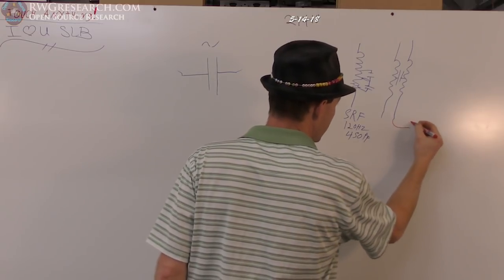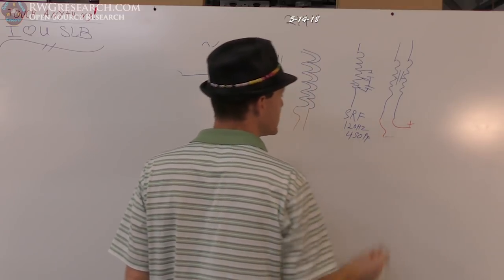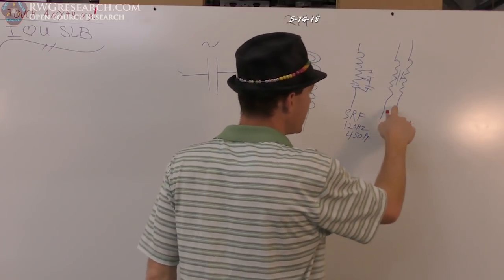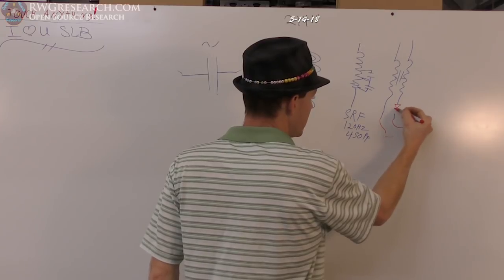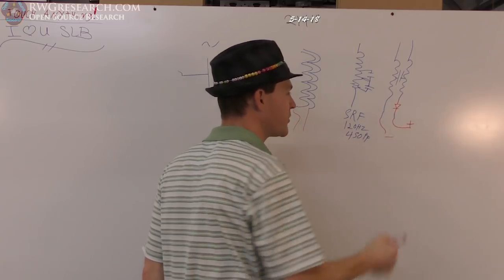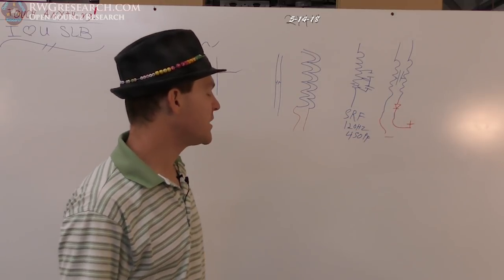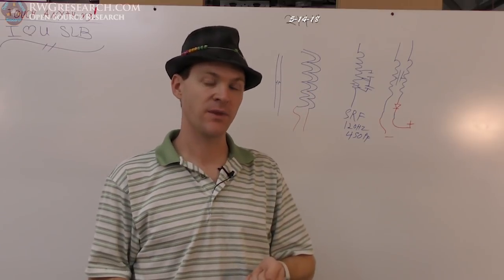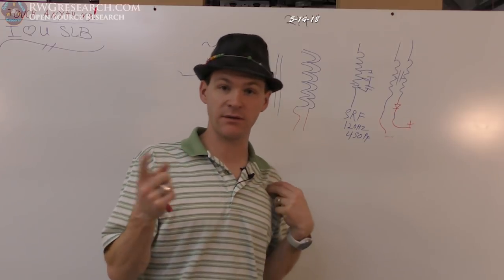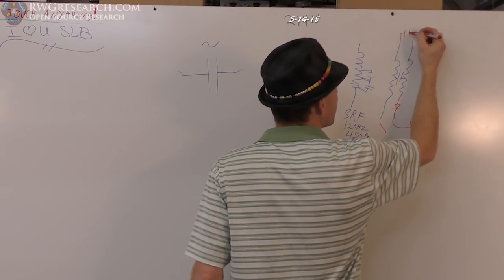If I remove this load, I can actually charge this coil — this terminal will have a positive voltage and this will have a negative voltage, depending on how the magnet is oriented. If I put a diode in here, I can produce a different effect: I can keep the current from going the wrong way and actually store the potential. Without a diode I can only charge on a half cycle, but with a diode I can charge on a full continuous revolution with just one diode.